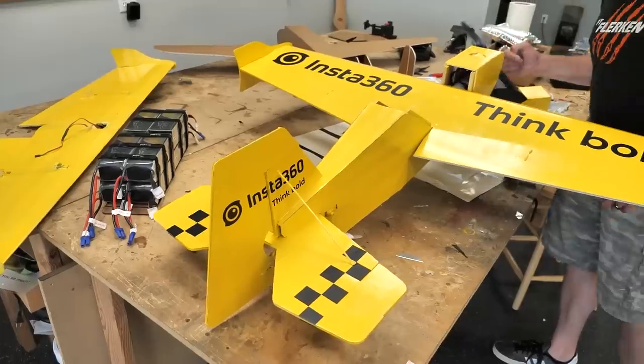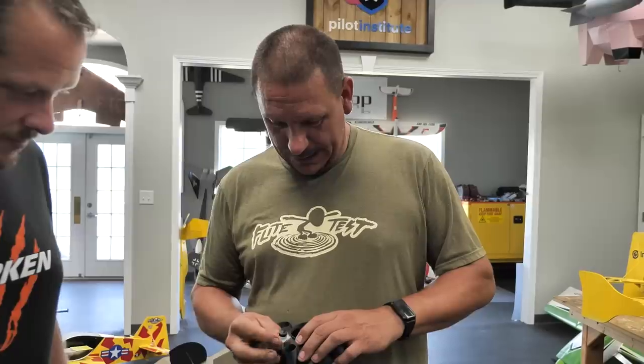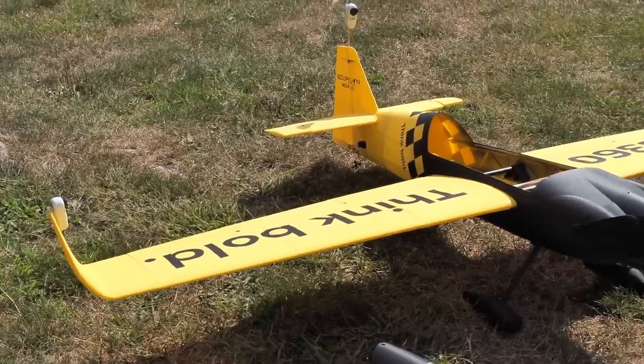The goal is pretty simple — we want to create the camera angles they used in the Red Bull tunnel flight. There are so many cool angles, but what we don't want is our FPV gear being visible through the camera. We're trying to figure out really clever ways to hide our FPV gear both on the FT3D XL and the MSXR V2. Dave thinks if we hollow out the bottom cowling piece, heat it up a little, and shove the camera through, it's going to fit perfectly right there. The concern is how close it'll be to the prop, but it might actually make the prop invisible, which would be awesome. We've got all the Insta360 go-to's already mounted. Center of gravity is critical — anytime you put cameras on, make sure your CG is balanced both laterally across the wing and left and right, so you don't have to put in extra trim.